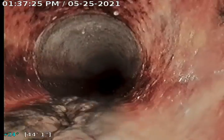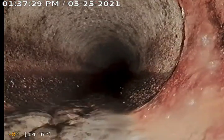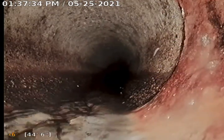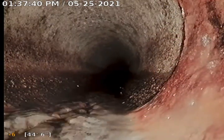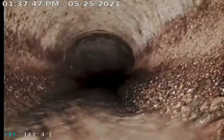We're going to transition here. So this signifies a few things. This signifies transitioning pipe size, so we're going from 4-inch pipe into a much larger pipe, probably like a 6 to 8-inch pipe. It signifies a transition of pipe materials, cast iron into concrete. And then lastly, a transition into the city branch piping. And even though we enter into city branch piping here, technically all of this will be the owner's responsibility throughout the entire length.